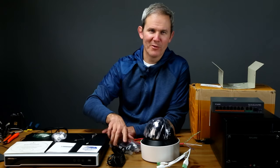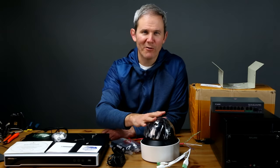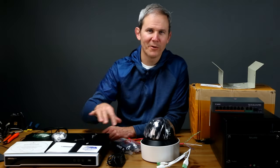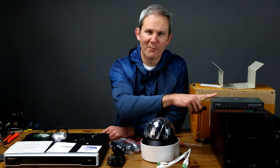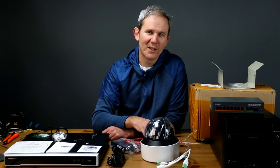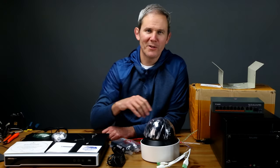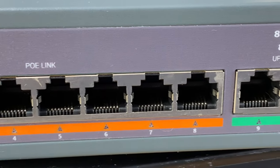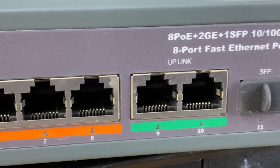Next we have a 3.3-amp, 40-watt power adapter — interesting because cameras don't usually include power adapters. This camera can consume up to 18 watts, which is over the levels of normal PoE, or Power over Ethernet, where the network video recorder or PoE switch powers the camera over a single cable. Normal PoE has a limitation of about 15 watts, so to power this camera we're going to need more power.